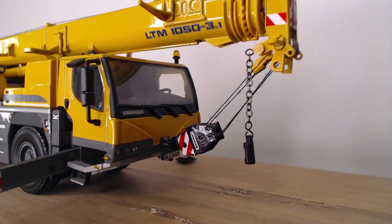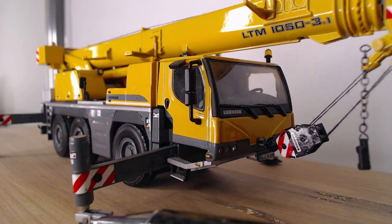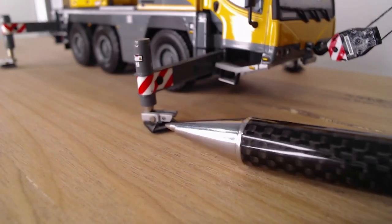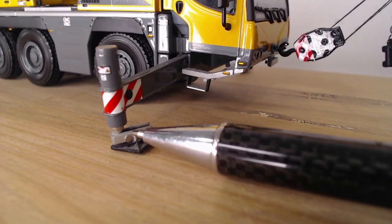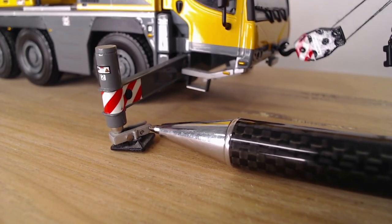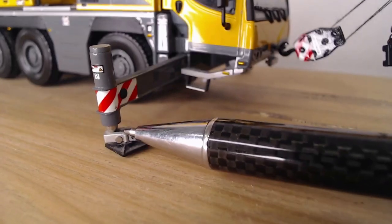Third thing is, once the outrigger is out, you want to put the slider into the center. So we see the slider here. See how it's not in center? See how it's on the pins? That's how they have it for travel. So you want to slide that down so the ram is in the middle.